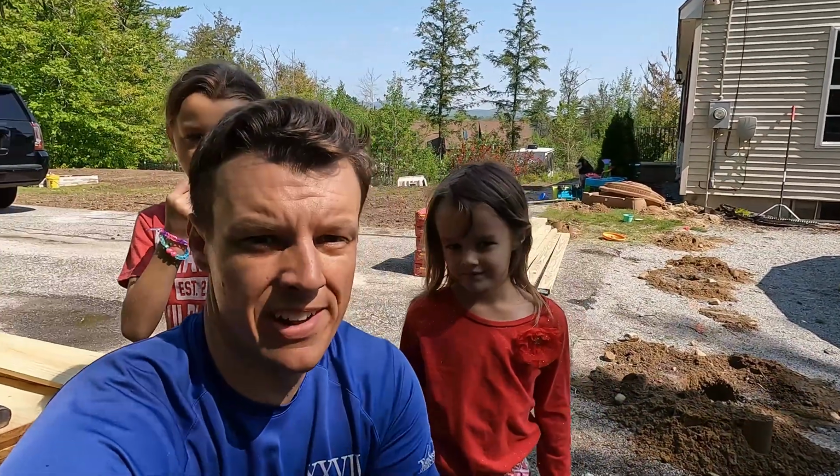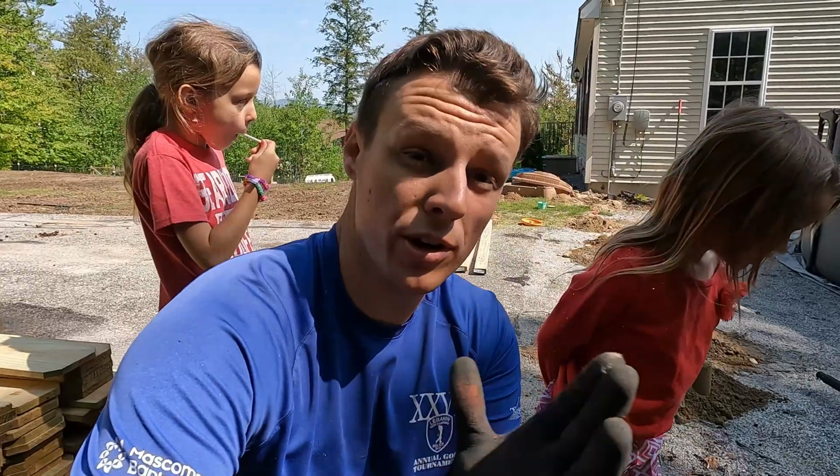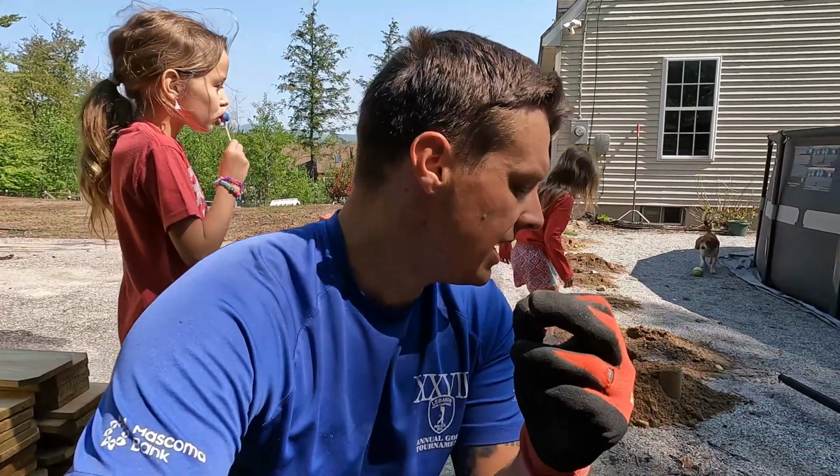What I'm gonna do is grab a bag of concrete. Basically, I'm gonna pour a little bit in the bottom of the hole before I do the post. And then, yeah, we'll fill it up. We'll use our level and we'll get those in.